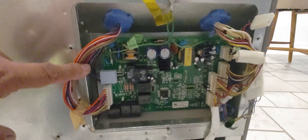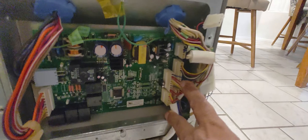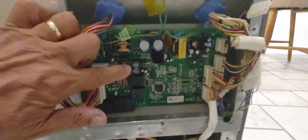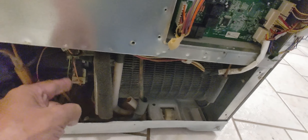However, I was still getting a clicking on this side, so I opened up the control board and started looking into it. I checked that I was getting AC voltage on the high voltage section — that was working fine. The low voltage section was not there. The way I check the low voltage is this board requires 12 volts DC, and we're concerned with connector J2. The clicking was coming from the relay that switches the high voltage onto the compressor and the condenser fan.